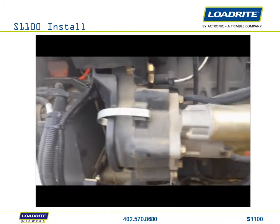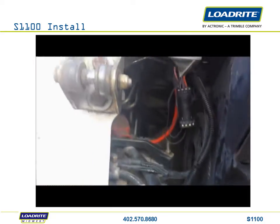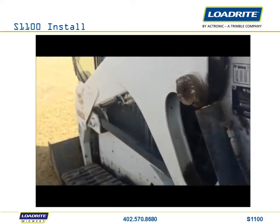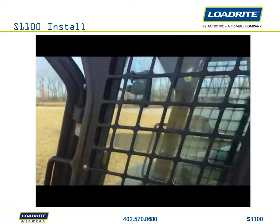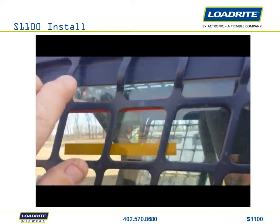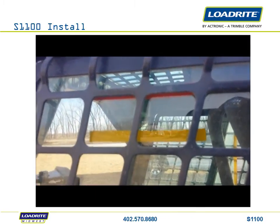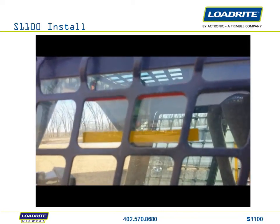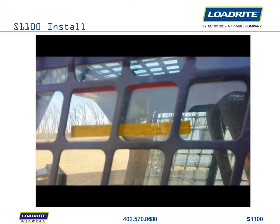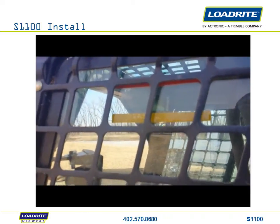Ran our wires through. We stayed away from the top where the exhaust was. Kind of ran it back through this bottom here and then back, and it went up into the cab from here. You can see our stopping points. We actually use the bars right here. This is where we're going to, and dropping to our yellow and pushing our weigh button. Those are eye height for me. I mean, they could be adjusted for any operator. It's kind of a fast solution, what we used, and it actually worked out pretty good. We didn't have to do any welding or any attachments to the outside.